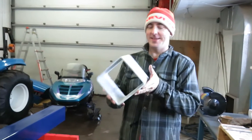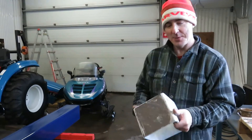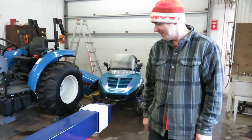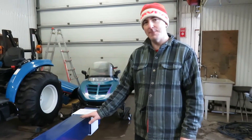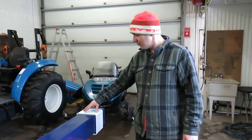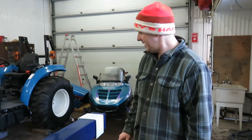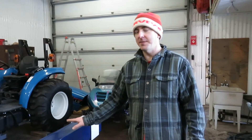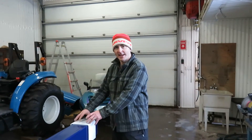The next step: I have a 7-inch by 7-inch square tubing cut at 6 inches — this is the collar. It goes over top of the beam like this, and there's going to be a hook right here. If I want to use the lift with the beam to lift anything, I can slide the collar or hook anywhere along the length of the beam, giving me flexibility. I'm not modifying the beam itself — not drilling into it or welding onto it — which preserves the overall strength.